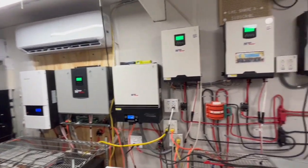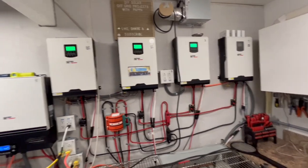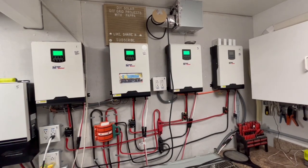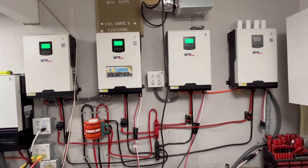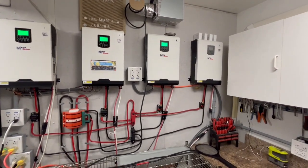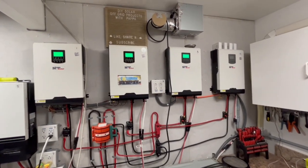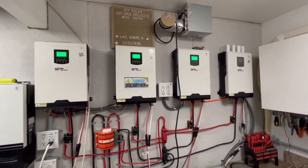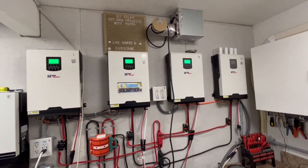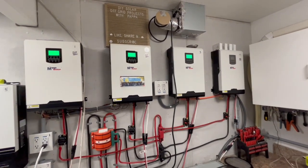So on all these inverters I'm able to connect four 250-watt panels in series. That would make my current be — I believe it's around 8-point-something amps coming in — so about 32 to 33 amps coming in off four panels connected. When in series, the voltage is four times the panel voltage but your current stays the same. But if you run it in parallel, then you increase your current. So if it was 8 amps on one panel and you ran it in parallel with another, you'd have 16 amps. Put it in parallel with another two for a total of four, that would be 32 amps.